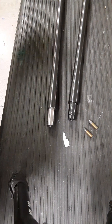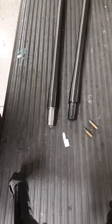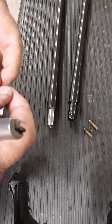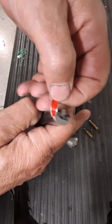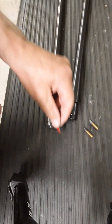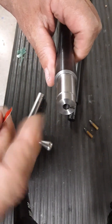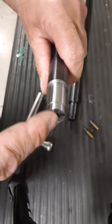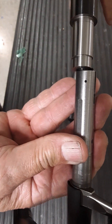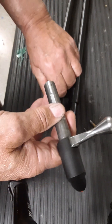If you did bottom it out, you wouldn't be able to close the bolt. What I do is I typically use a .0020" shim when installing the barrel — between the furthest forward part of the bolt face and the breech end of the barrel. So there's basically a .0020" clearance between the bolt and the barrel when it's assembled up, and that seems to work really well.